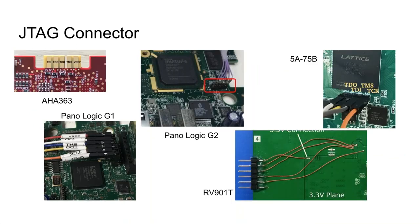The next step is finding the JTAG connectors. Since FPGAs need to be configured most often by a flash, the most convenient production approach is to assemble the whole board with an empty flash and program it on the production line, which means there must be easily accessible test points to talk to that FPGA. Most of the boards I've used have a fairly obvious way to connect to JTAG. The RV901T is an exception where you need to do very accurate soldering to some test points to get that interface out — that's a bit of a hassle, and I try to avoid boards that require this.